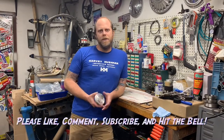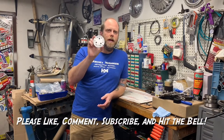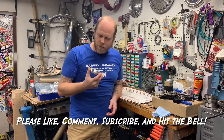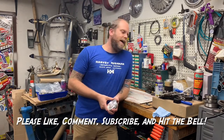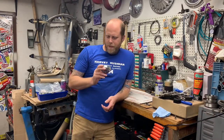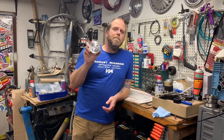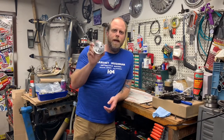So if you tuned in last week, you saw that I took my quick release steering hub adapter and I screwed it up. I broke a tap off. I broke an M2.3 by 0.45 tap, little teeny guy, which was the wrong size, and I snapped it off in the hub adapter. I was able to get the tap out, but I chewed up the adapter pretty good doing it.